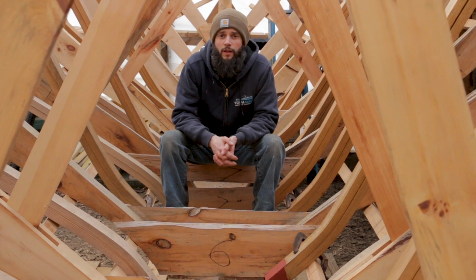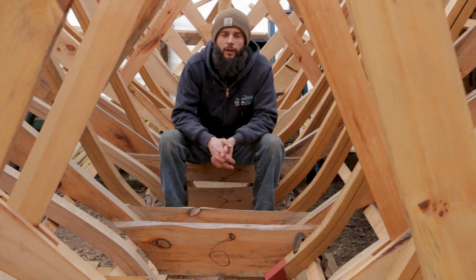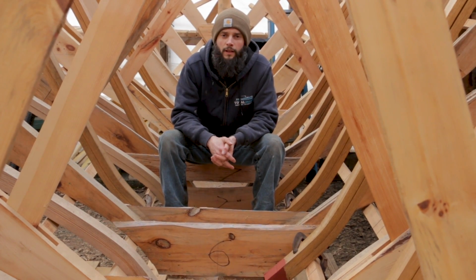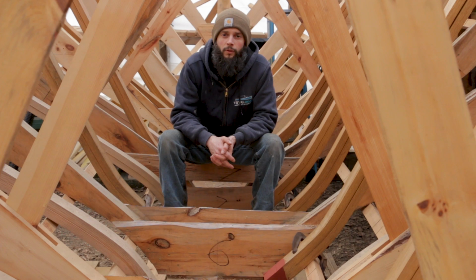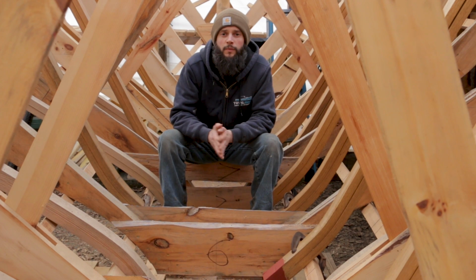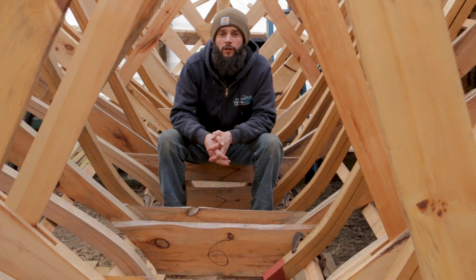After we steam bent all the frames, we left them clamped in place for a couple days so that they could be totally cool and dry and make sure that they were well adjusted to their new home and their new shape. And once that was done, we've slowly been going through and cleaning up the frame sockets, doing any final little tweaks there, taking the frames out, giving them a quick sand, shellacking any of the fay surfaces where two wooden pieces meet up, and then giving the rest of the frame a coat of Danish teak sealer.